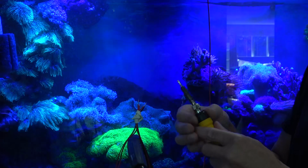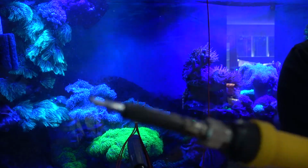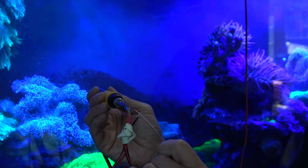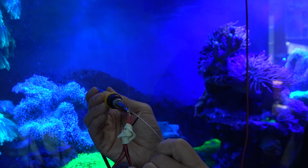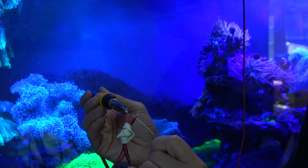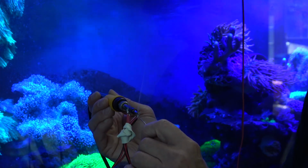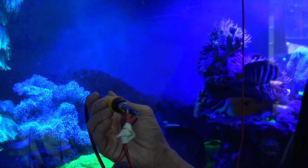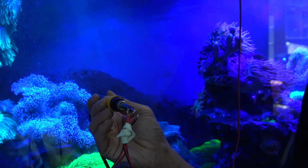So big fat wires, that means I better use a big fat tip, right? Can you hear it? It's getting hot. Oh yeah, that looks like it's getting hot. We're just going to saturate these wires, get them completely covered in solder. That is a nice blob of messy, messy, messy solder on the hot wire. For the positive, we want that solder right into all the individual wires, up and down along the sides, make sure it gets nice and sopping full of lead.